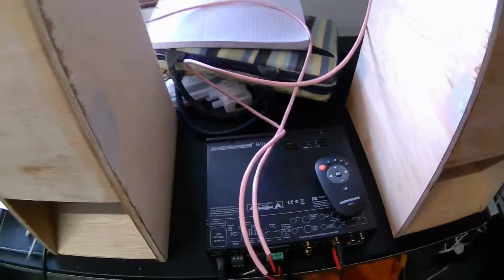What I am finding now with this amp, not even at full volume, is that these speakers can't handle bass at all. The range of movement in the cone, or the coil at least, is so small. It can produce certain bass tones, not too badly even, but as soon as you start turning up, give it a bit more power, you can hear it clipping immediately, and there are certain bass frequencies which it doesn't even hit at all.